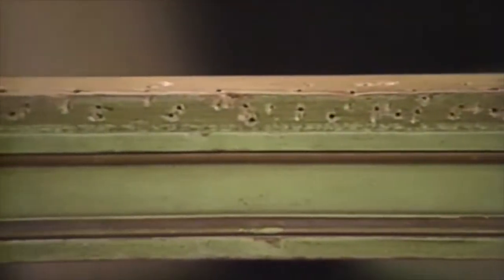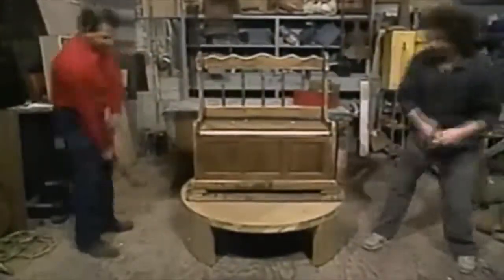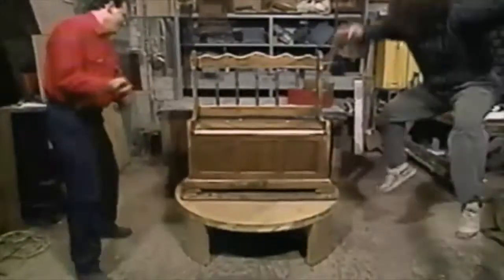I think it is time to cross over and begin refinishing the frame of the chaise. If you remember last week, we put on our last layer of gray, which is the gray that you now see. Underneath that we have a darker gray. Underneath that we have our primer, which had a little black into it, so it also was a gray. And underneath that, we have the actual green that was on the chaise to begin with. What we're going to do is we're going to distress with a paste remover. And unlike the last distressing where we beat the piece of furniture up, this one we're going to do with a paste remover, removing some of the layers of paint through the action of the paste and varnish remover.